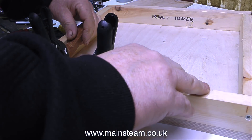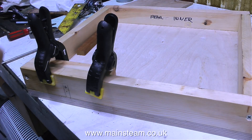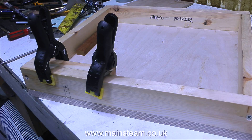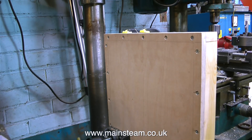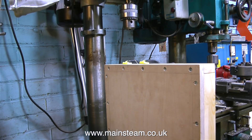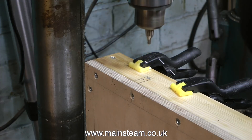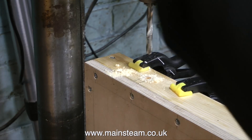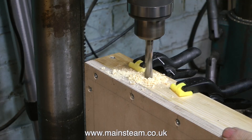It's most important to think ahead — the reason I have that piece of hardwood is to gauge where the wood needs to be, because all the way round the underside is a piece of hardwood and if I don't make allowances for it, when I try to put the top on it won't fit. This is my floor mounting pillar drill that I never got round to fastening to the floor — that's why it wobbles. I dropped the table right down to the bottom and held the base edge on so I can drill holes in the top. Two heavy duty spring clamps hold the inner piece of wood to the outer piece so the hole goes through both in exactly the same place.